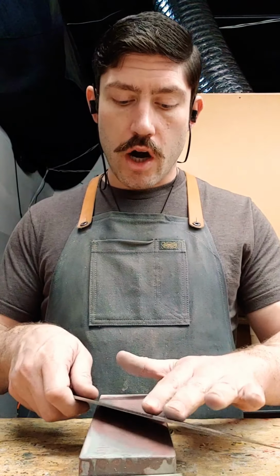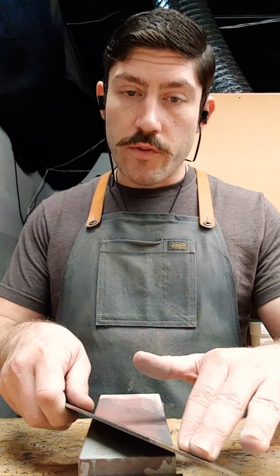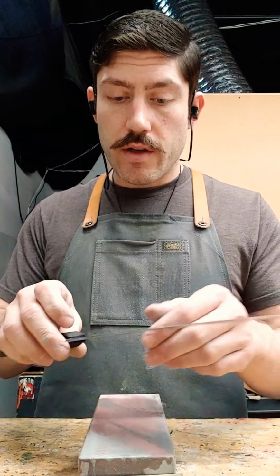Now when I'm sharpening, what I'm trying to find is that overhang of steel. If you can see a point, it's dull, okay? This is the worst. It won't cut. It's rounded. How do I fix this? Well, you need to flatten these sides until you create a burr that overhangs. That overhanging steel, that's the burr, okay? Developing that burr is something we do at a lower grit.